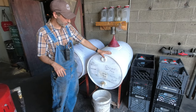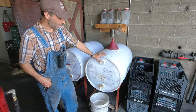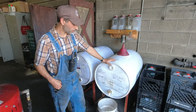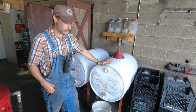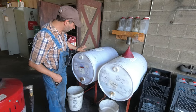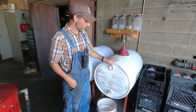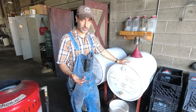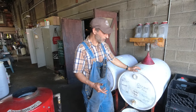This product here is Oxygon. It comes from a guy named Mitch George — he has a company called Cannonball and he's pretty much one of the biggest suppliers for boiler treatment for steam locomotives around the country. His stuff is fantastic, he knows his stuff, and his treatment works very well. In the simplest terms, Oxygon is essentially an oxygen scavenger — it removes oxygen from the water. The less oxygen you have, the less ability you have for corrosion and oxygen pitting, so this helps lower those problems.